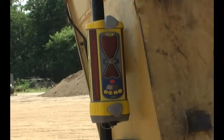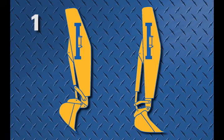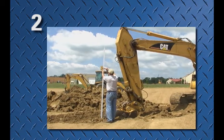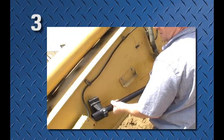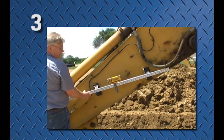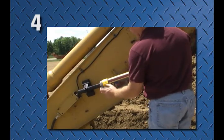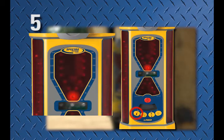To summarize the 5 setup steps: 1. Determine the bucket's reference position — open, closed, or other. 2. Measure and record the setup length. 3. Install the MM1 at the correct angle so that it's pointing to the bucket teeth. 4. Clamp the LR60 to the MM1 so the center triangle is at the setup length. 5. Enter the setup length into the LR60.